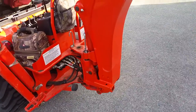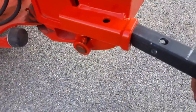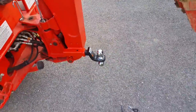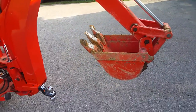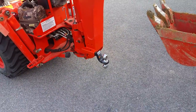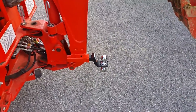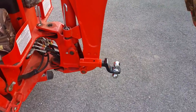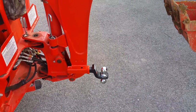I'll slide the ball hitch in here — I'm not going to put the pin in, but you get the picture. Now you've got your trailer hitch in there and you're ready to pull a trailer once you put your pin in. You still have to keep your bucket up a little bit to clear the tongue. If you want to avoid that, you could make your own trailer ball hitch with about a five-inch drop instead of two-and-a-half inches — that would probably clear the tongue, but you have to try it first and check exactly how much drop you need.